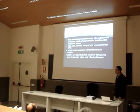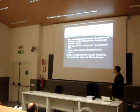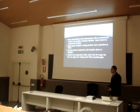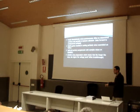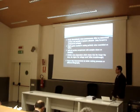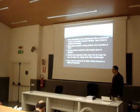And the electrowetting on the dielectric, it was really time dependent, as I discovered, because the longer the time I put a droplet, the higher the voltage is needed to have a contact angle difference. Future chip improvements are being looked for, such as etching processes, because we have done another chip with better etching, and we are ready to make more experiments with that.